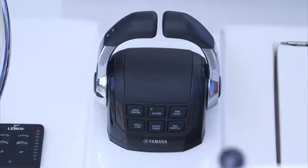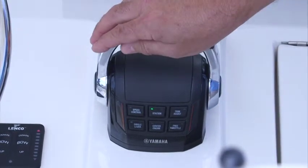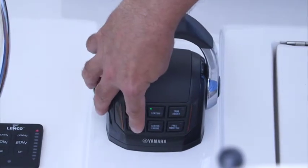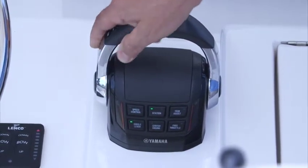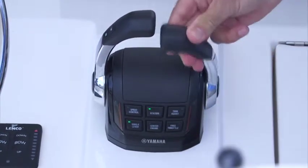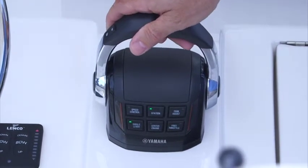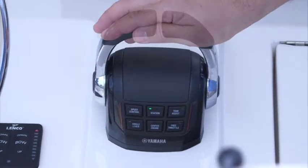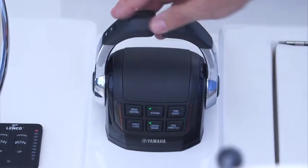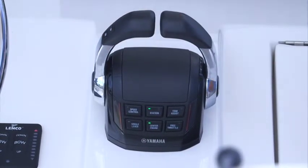The three buttons on the bottom row can be activated only when the outboards are running and in neutral, and are deactivated again by pressing each button. The Single Lever button allows all outboards' shift and throttle functions to be controlled via the port shift and throttle lever. When in this mode, the starboard handle may be placed in any position for operator ease and convenience. Both shift and throttle levers must be in the neutral position before Single Lever mode can be engaged or disengaged. On triple outboard configurations, the center engine button allows operation of the center outboard via the port shift and throttle lever, which is helpful when trolling or attempting to balance operating hours between the engines.